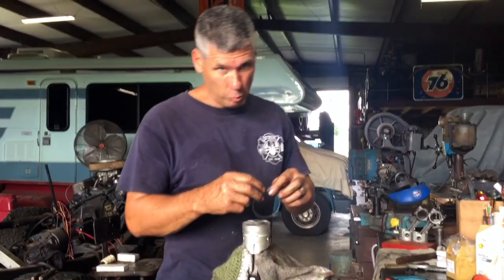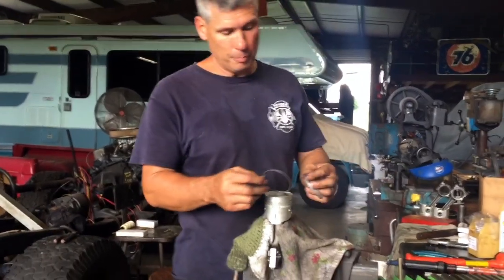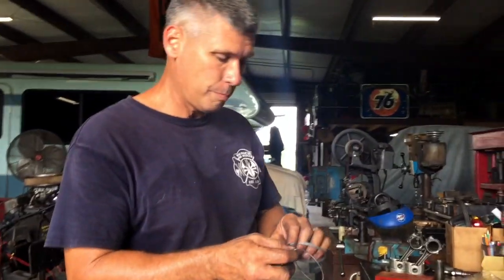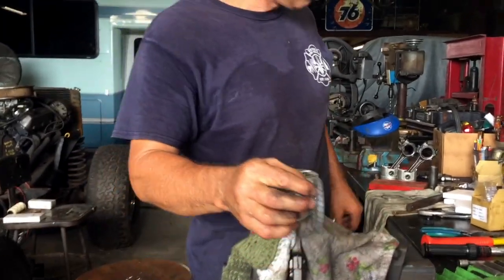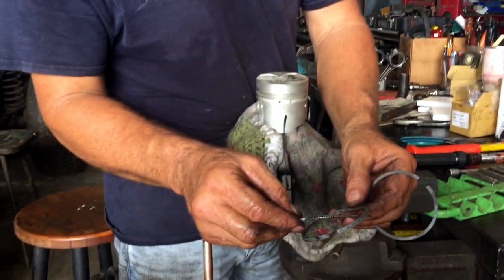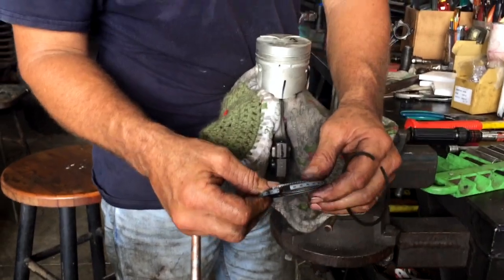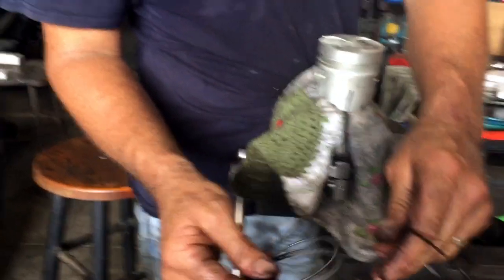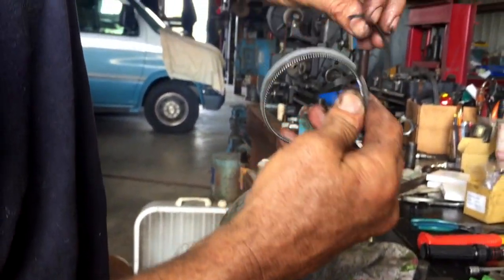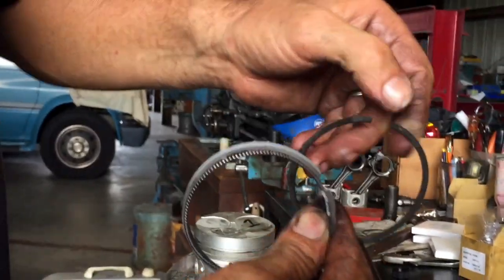We're gonna put these rings on these pistons, and these kits come with a two-piece oil ring instead of a three. It makes it a little easier. So you have the oil ring. There's two parts to it. There's the inner spring part that actually retains oil to lubricate the piston and the cylinder. You got the number two compression ring on, and if there's marks on the tips of the rings, right there, that always goes up.